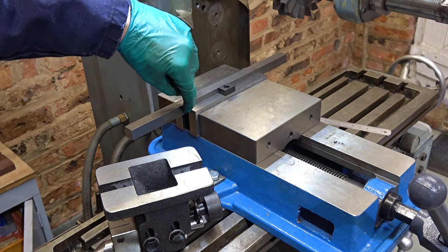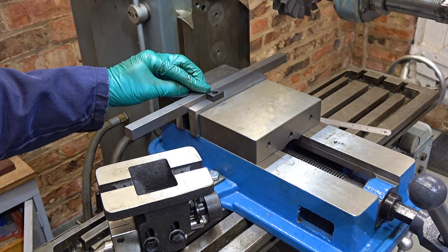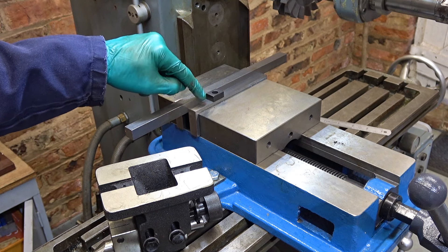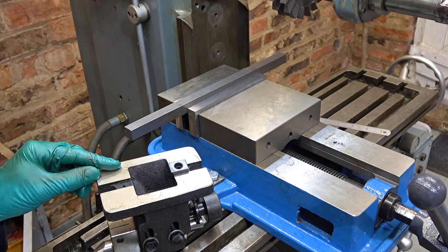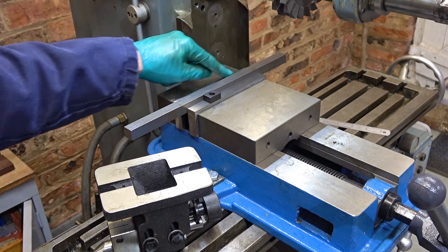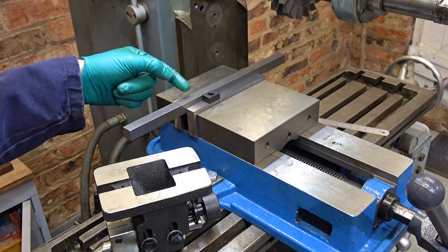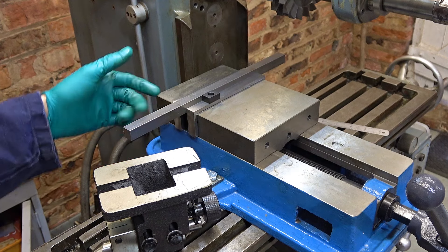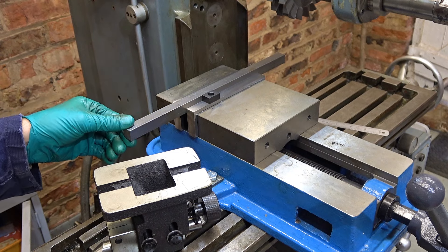The original keys are about the same height off the face of the vice jaw, but that includes the three millimeters that went into the channel. I'll cut down to just above the jaws, then flip it over the other way, drop it in, and machine the underside — which will become the top surface — down to three millimeters tall off the jaw. That should be about right for size.